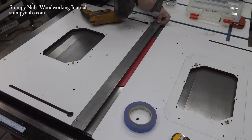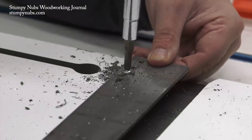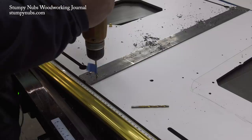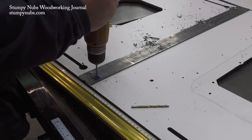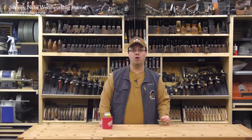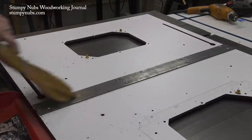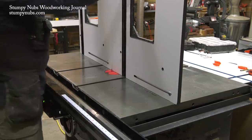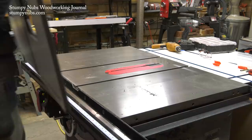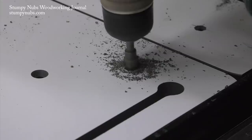Here's another terrible idea I had: I planned to attach a flat bar to the seam beneath the two table tops to fuse them into one so they'd be nice and flush. First of all, it's a pain to drive screws into phenolic — it will not compress like wood, so your pilot holes have to be almost as large as the screw threads and you have to drive them carefully or you'll twist the heads off. After all that work, I realized the two tops must have come from different factory batches because while they were close in thickness they weren't exactly the same, so I ended up with a ridge on the top. I had to tear that all apart and shim them separately.